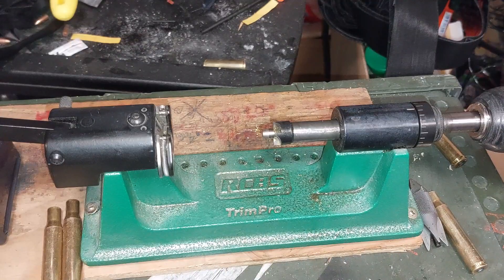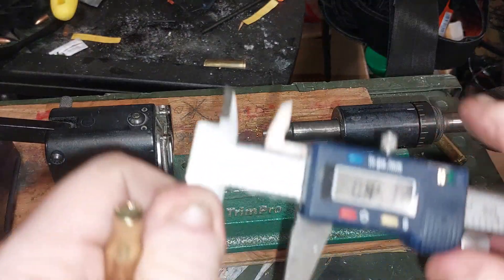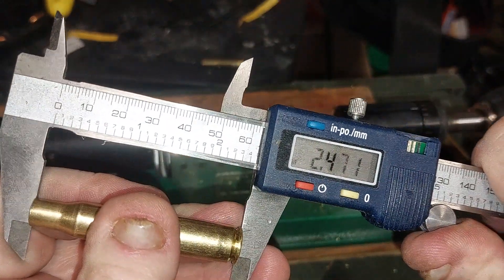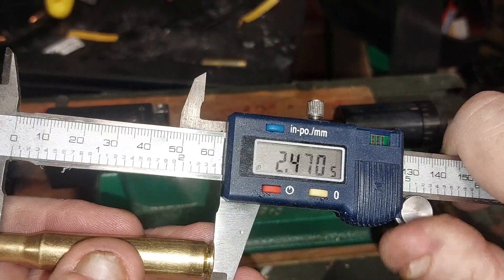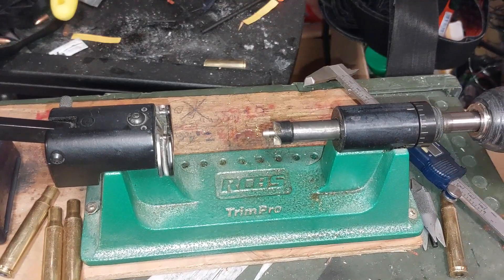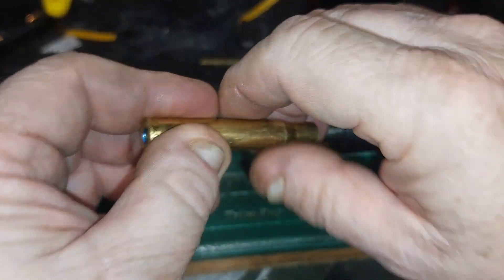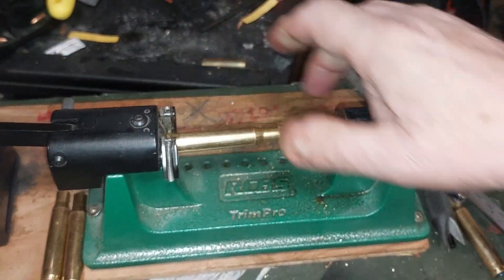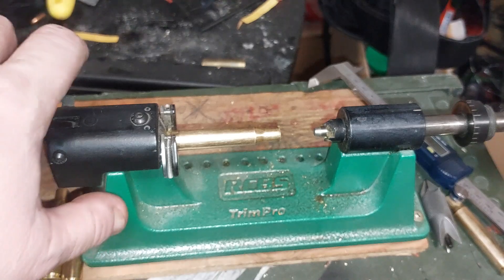Let's grab the calipers. I just dropped mine so I went and re-zeroed them. You can see this one is measuring 2.470 inches. Let's see how repeatable that is. You can see it says 270 Win, but in all respects it's 30-06 brass. I let it zero itself and straighten itself out, because it's got two jaws here that are held in tension.